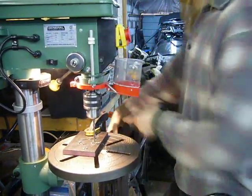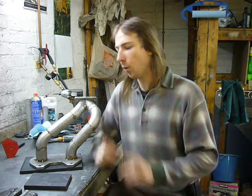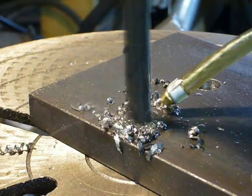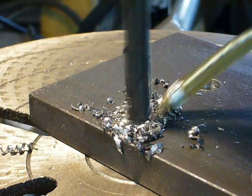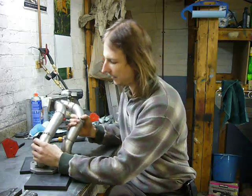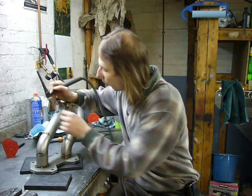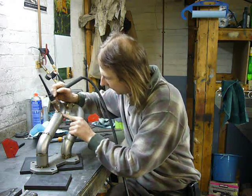It was brutal. And the second reason is to facilitate the back purge. Now, a back purge just isn't something that your girlfriend does after a night she'll be ashamed of. What I'm referring to is filling the entire manifold with argon gas to displace the oxygen that would normally be inside these tubes. The reason you need to do this is while the outside of the weld is shielded by